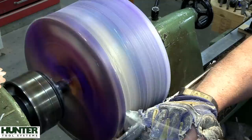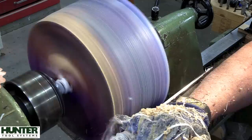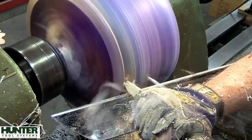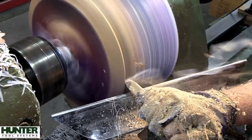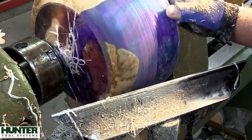But you know what? I'm really finding that you can tailor how fast you want this resin to cure by temperature. So I'll do an experiment next time and bump it up to 75 degrees Fahrenheit. And from there, we'll see if we hit the 14 hour or 12 or whatever it is you're shooting for. I don't want to have to go out at midnight and mix up the resin so that it's ready to go at 9 o'clock in the morning. I would prefer not to do it that way. If I can do the 14 hours, then I think that will work out best for me as far as mixing time is concerned, and then getting out to the workshop to get it poured.